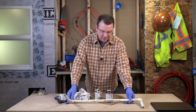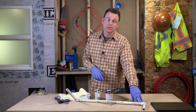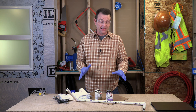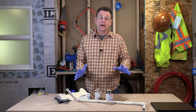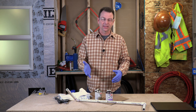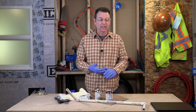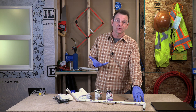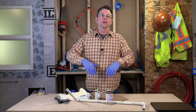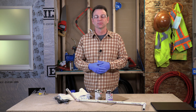Here's what happens if you forget your marks or you don't make your marks. I've got a situation here where if I wait another five minutes, the only option I would have to fix this mistake would be to cut out a section of this pipe and glue in new fittings and pipe. This is wasted time and money. Hopefully this demonstrates the idea of marking the pipe and lining all those marks up so that when you take everything apart and put it all back together again, it goes back the way you dry fitted it in the first place.